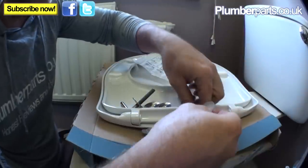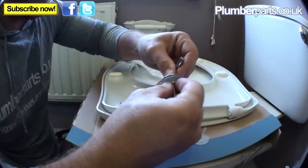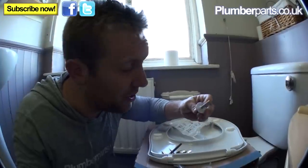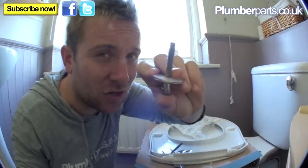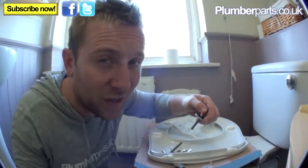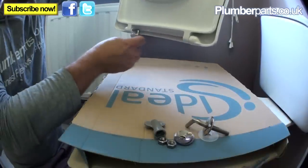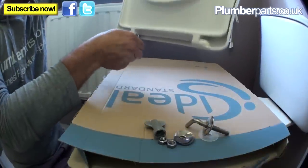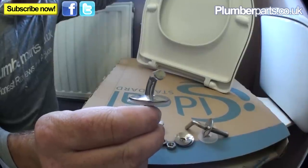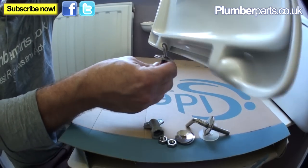You need some way to stop any yellow water going down onto the floor if someone misses. We put a little plastic piece on here — it sits up against the porcelain of the loo and stops any of that lovely yellow water giving you a lovely yellow floor. I always want the loo to sit forward as much as possible so we don't get that rocking-forward issue. There's an angle on this, so you want to set it up accordingly — angled forward like that, so it doesn't fall forward.